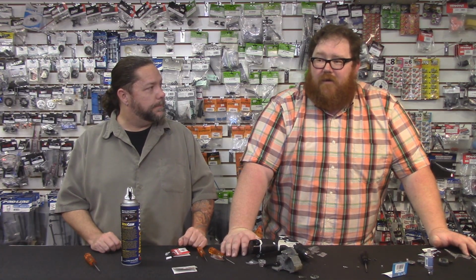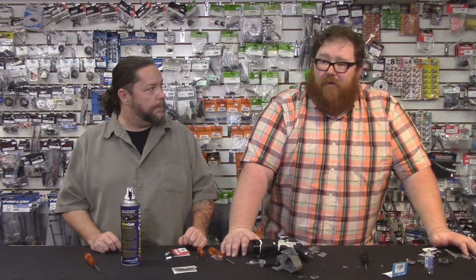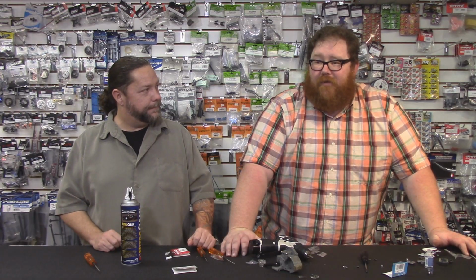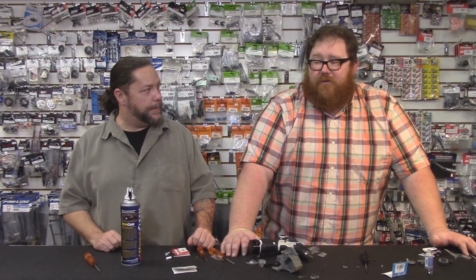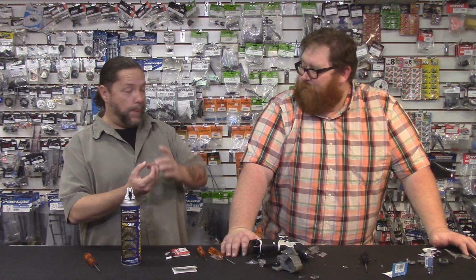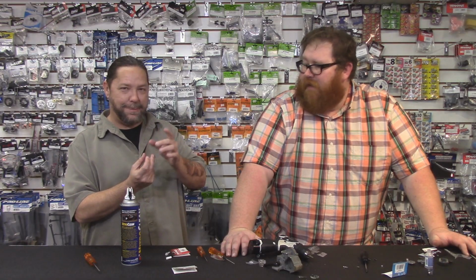The problem you run into is that you're screwing the gear. The center gear is separate from the case, so you've got to line the center gear up, and then line up the top part. So you're trying to get three pieces to line up all together, and if you don't, then the screw can't find the threads in the bottom part. In theory, it's very simple, like you saw the way it goes together, but you may need some precision and some patience.